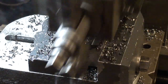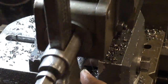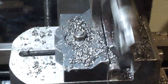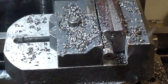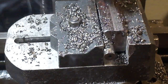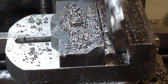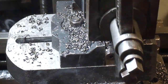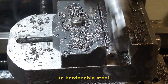For the final side, I have the bottom of the V-block set against the jaw, and in the V-groove I have a half-inch rod to space it off the jaw a little bit. That way it's nice and square — square on each face and parallel to the V-groove itself. Even though the rod was tapered, it would have been a lot easier to start with straight rod, but I didn't have any, especially not in hardenable tool steel.